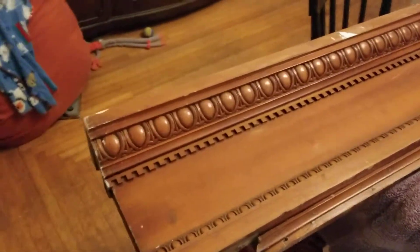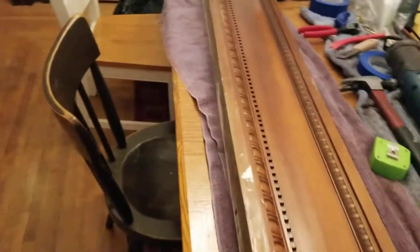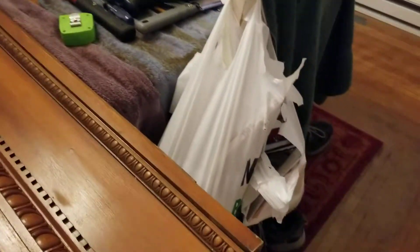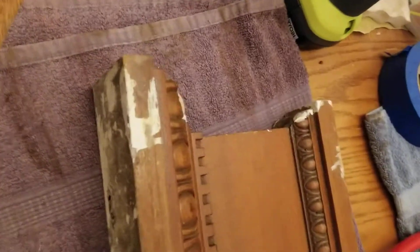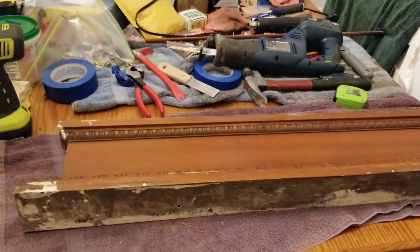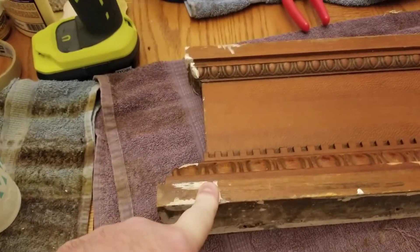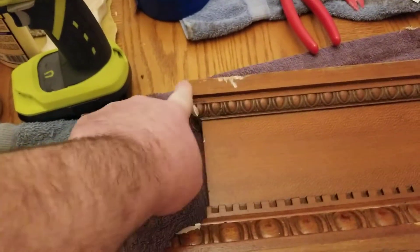Every piece has to be cut separately — you can't just take a saw and cut straight through, because you'll end up with everything just cutting straight off and you won't have the nice return on there. The only way to return it is by taking everything apart to get enough molding to return the edge. Plus, if you cut straight, you'd end up cutting this piece which you need to extend over quite a bit, and you'd cut this piece which you also need to extend.